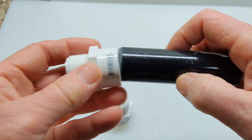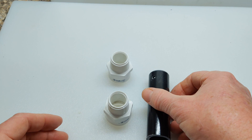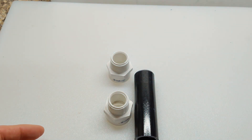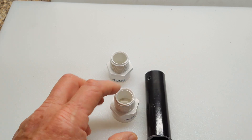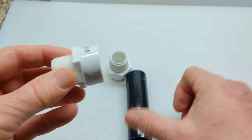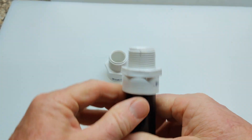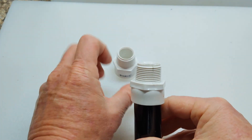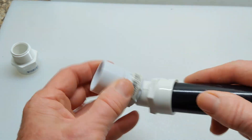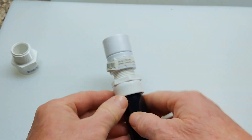What you're going to do is slide it over here, but you can see it doesn't fit. So, using a heat gun safely — that means using gloves and some kind of tongs to hold these things because the parts are going to get hot — you're going to heat up this section until it gets pliable enough that you can slip it over this end, just like this, because I've already done it. Then you're going to build everything upon that, and this is your swivel. I'll probably remove that O-ring because you don't need it, and then you go from there.